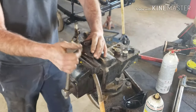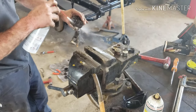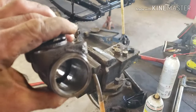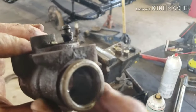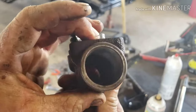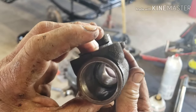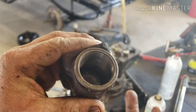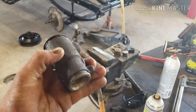I'll show you guys what it looks like done. That's the honed side — now look at the side we haven't touched yet; you can still see all the corrosion in there, that's what we're trying to get out. We'll double-check everything; if it needs a little more honing we'll go again. It actually does look pretty good, and that's what you're after — it's just like getting an engine cylinder ready. I'll get the other side done and show you how to put it back together.